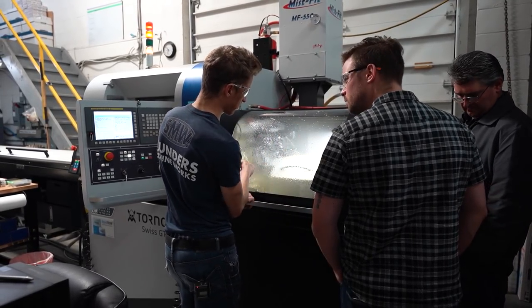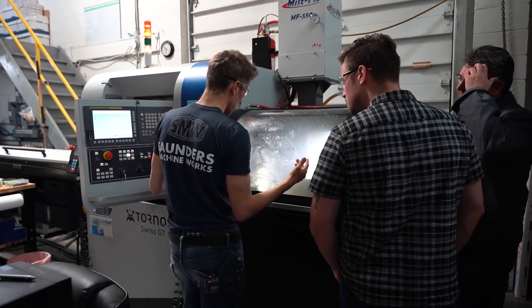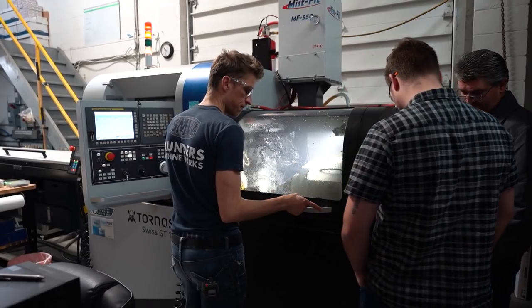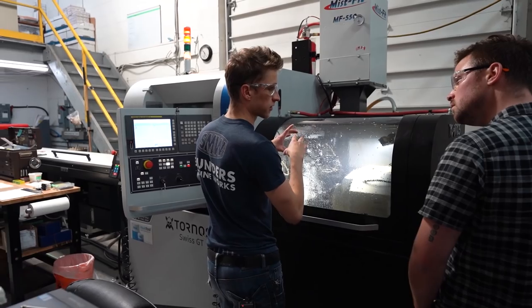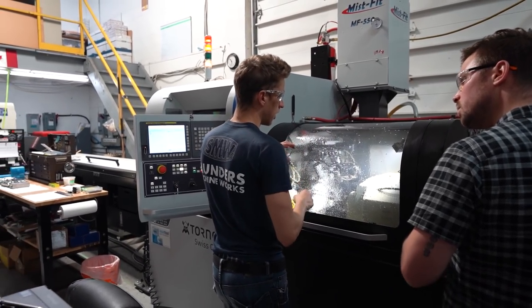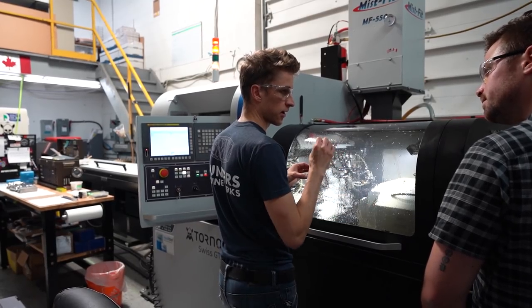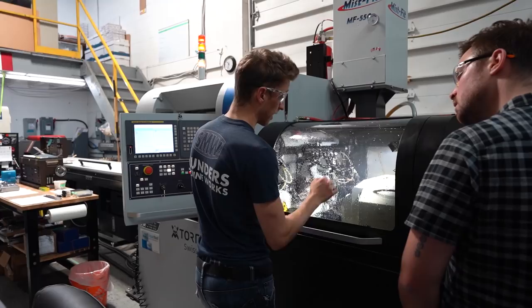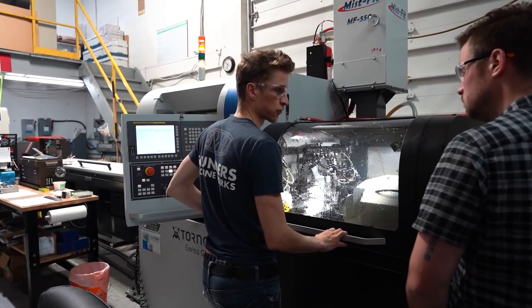It's got coolant through the subspindle. So, interesting thing. For parts you want to be pretty, coolant through the subspindle right before transfer, you hear woo, cleans everything off. Otherwise it'll smear, there'll be chips that get everywhere, it'll clamp, it'll look dumb, it'll be bad tolerance. So I like that feature a lot. Even if that's an option, I don't know, it just came that way, but that's worth paying for.